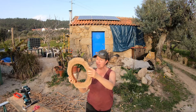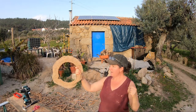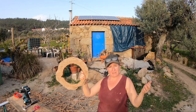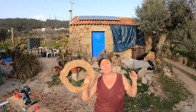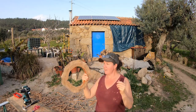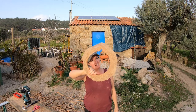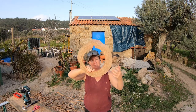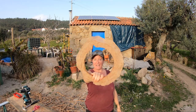The idea being that all of the porcupines, the screws, they stick into the space in the wall, and then I fill that space with lime. It grips onto the screws, holds the whole thing in place. I found a scrap of burlap. I've stapled that on the front because in my experience, burlap helps lime adhere to wood. So that's what this creation is all about.